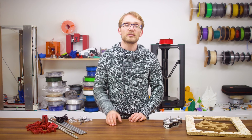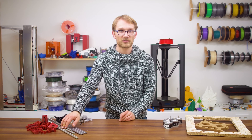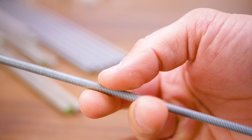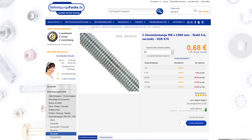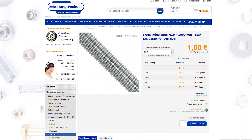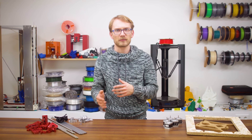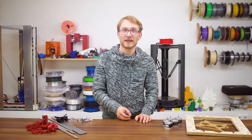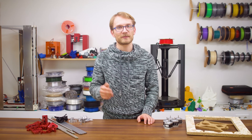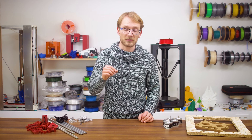Talking of fasteners, the full list of parts is on toms3d.org, but the ones worth talking about are the following. Threaded rods — there are three sizes: M5, M8, and M10. The M5 will be used for the Z-axis, so that one is sort of non-replaceable, but if metric threaded rods are hard to get or expensive in your country, you can substitute 5/16th and 3/8th-of-an-inch threaded rod for the M8 and M10 ones. One meter of each is plenty, but I did order a second M5 rod just to have a backup if one of them comes bent. Blank steel ones might be even cheaper than galvanized, but they will rust. Stainless is harder to cut and more expensive. If you have the option of different strength grades, pick the cheapest one — we're not going to get anywhere close to their yield strength with the MK2 build.